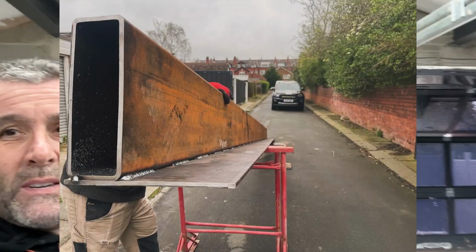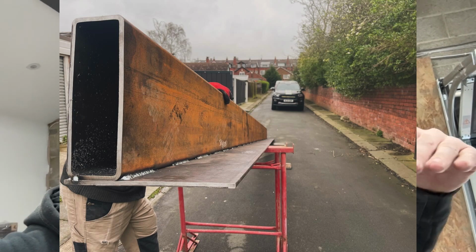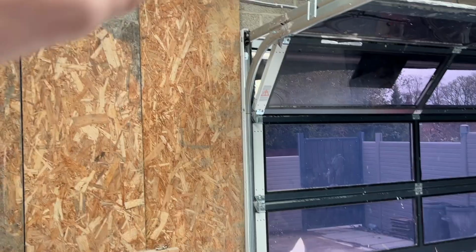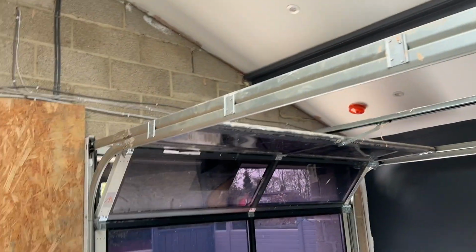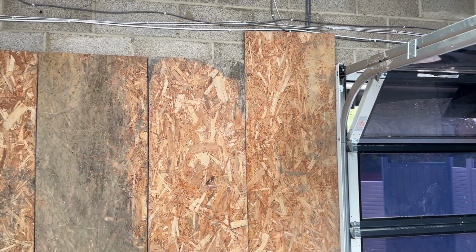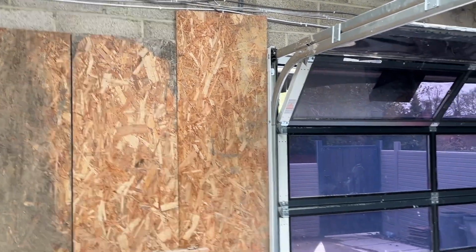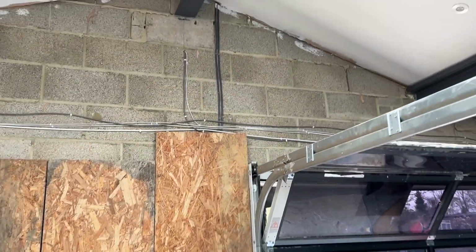So there's a 7 metre box section steel going in there with an 8mm plate welded to the bottom to take the outside skin. I would have no qualms whatsoever of putting a couple of Acros under that steel, a couple under that steel, a couple under that steel, prop them off the floor, get some strong boys on the outside skin, some strong boys on the inside skin, drop out the blockwork, get the steel up on a genie, pop it in, block it back up. Yeah, job's a good one.